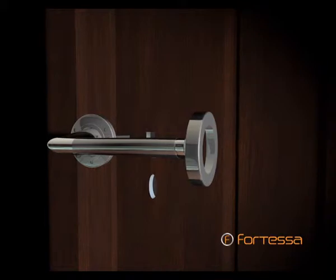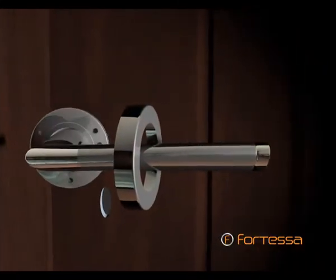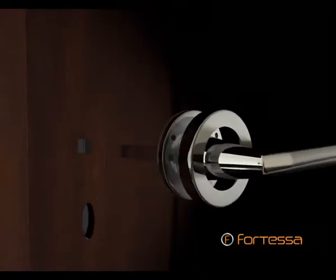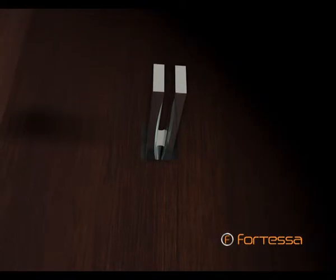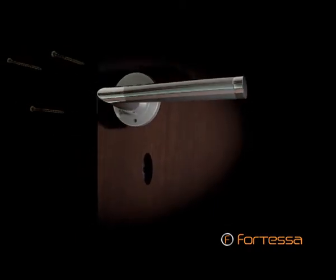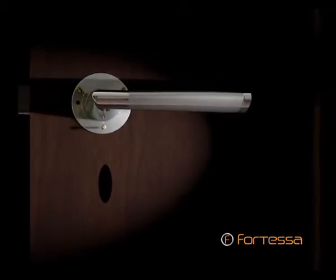The handles are now ready to be fitted. Each handle set comes in two components: the handle complete with base plate, and a rose with threading. A spindle is moved and arranged in the lock casing so that the grub screw on the door handle can later pierce into the specifically bored spindle ends. The solid mounting plate, fitted with a spring mechanism and firmly anchored to the door handle, slides neatly into the spindle. Each handle is then secured to the door with three wood screws.